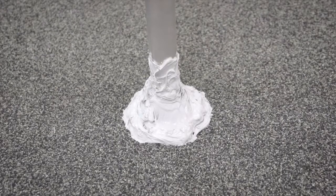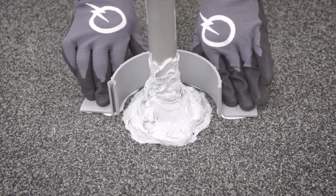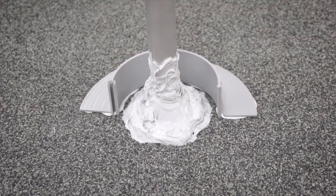Place a section of the E-CURB on the roof surface to form a half circle around the base. Press down firmly until the sealant extrudes from the outside edges.